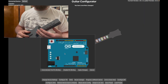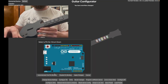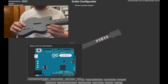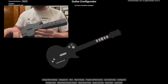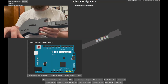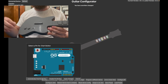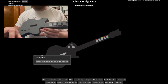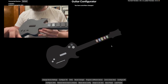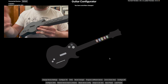Strum bar — strum up — hit automatically find pin binding, strum up, apply change. Strum down — same. Start button — find pin binding, start — and select, play, apply change. Looking at the pin assignments: I have 16 for start, 10, 6, 4, 3, 2, 5, 8, and 9. These are the pins on the board that are going to the actual controller.